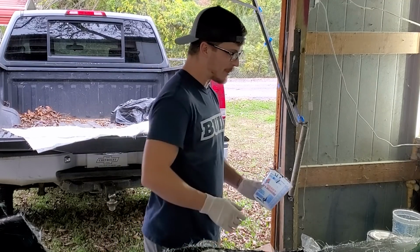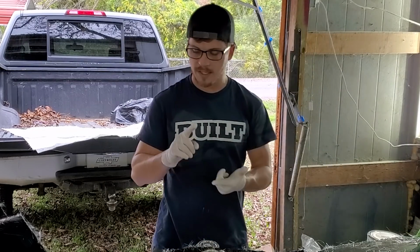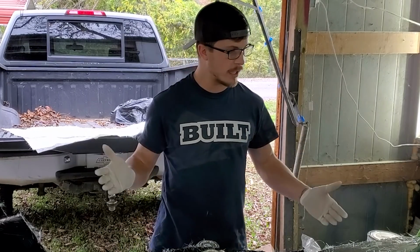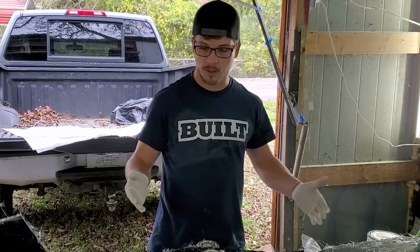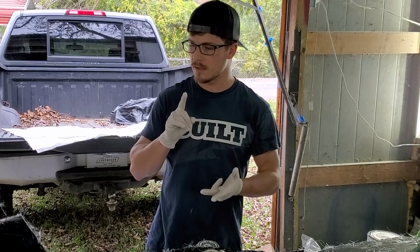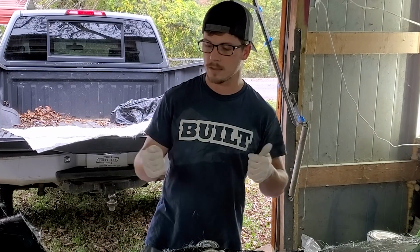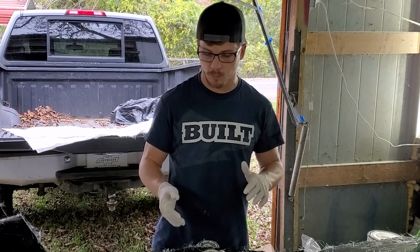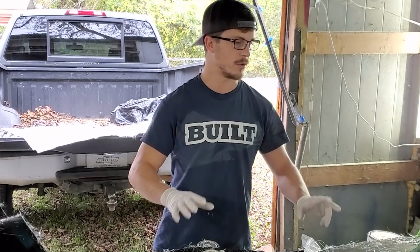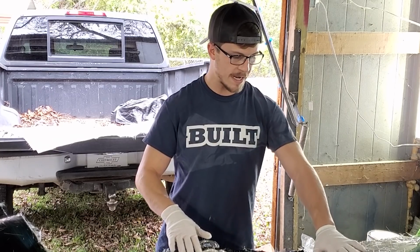So anyway, what we're gonna do is pretty much what we've been doing. We laid down some wax. We laid down our PVA release agent. We laid down a coat of gel coat. This time with the gel coat, I mixed the fumed silica and the tint before weighing and mixing in the catalyst, and that seems to have worked. It's a much more even coat, and everything is hard. There are no gummy or sticky places. It's a little bit tacky still, which is good.